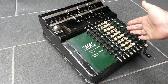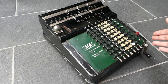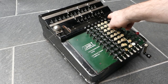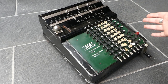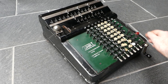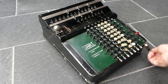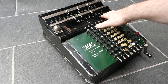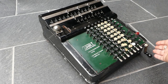This machine has an unusual mechanism. It's very straightforward to use — you just enter a number. It has a display register here for the input and the crank here. You can turn that clockwise to add the number, and that increments the counter, or you can turn it anti-clockwise and that subtracts the number and decrements the counter.